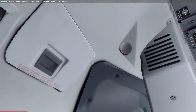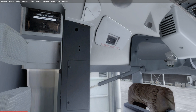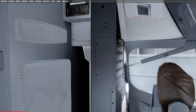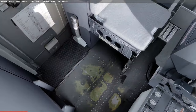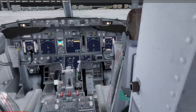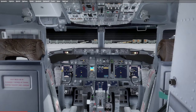Now we're going to come down and check the captain's escape rope. Again, don't just check that the rope is in there — open the hatch and physically tug on the rope to make sure it is attached to the airplane structure. Next we're going to check the circuit breaker panel called the P18 panel, and lastly the crash axe — make sure that it's stowed and secured. This is the end of the safety inspection and initial startup of the airplane.